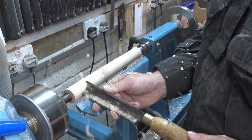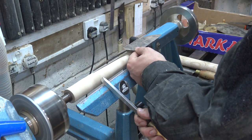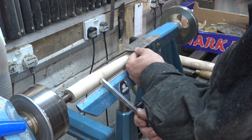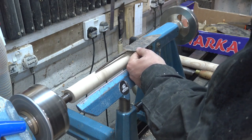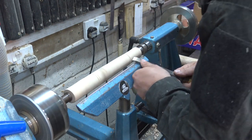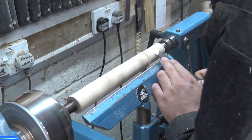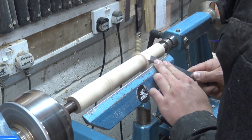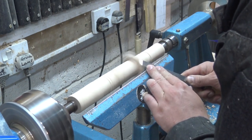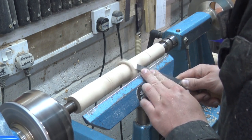As soon as it's roughed out into the round shape again from that oval, I can start putting on my marking. I'm marking out the length of the tang and I'll put another mark on with the skew chisel to indicate where I want to part this off later on. I've avoided the cracks — when the piece dried out it did have some cracks and I'm making sure they're not in my piece so it's nice and structurally strong. I'm going to be using the skew chisel here, leading with my long point then flipping round to my short point to do a planing cut across the entire piece. You can see the shaving following in front of the cut and we're getting a really smooth finish as a result.